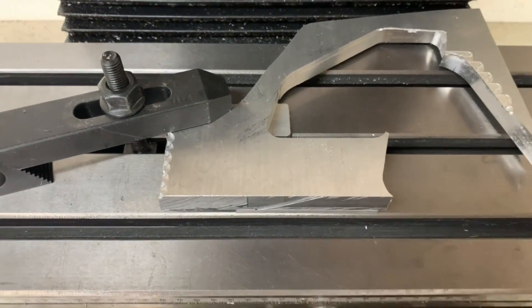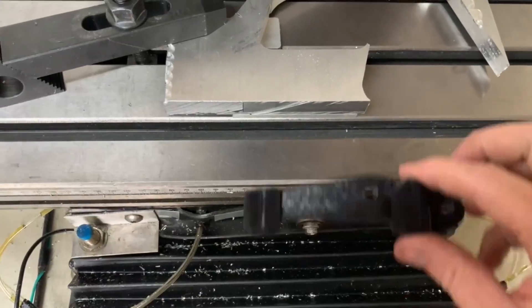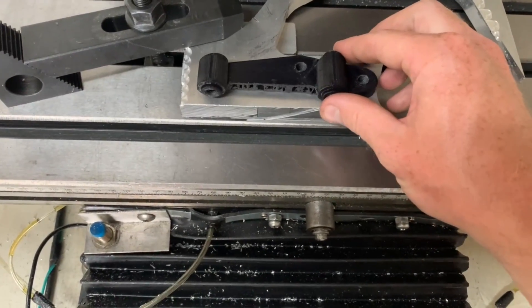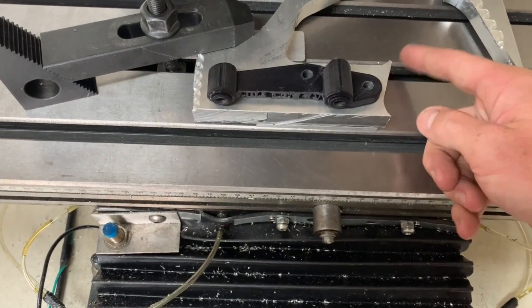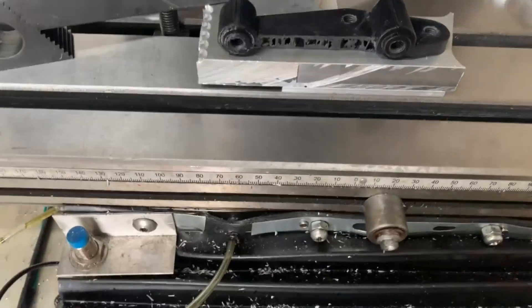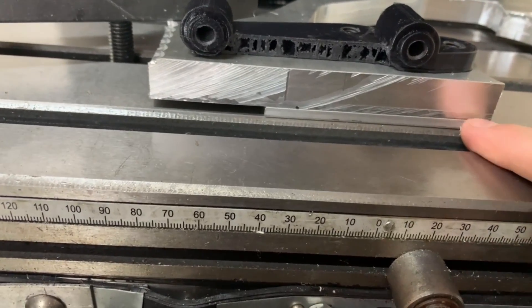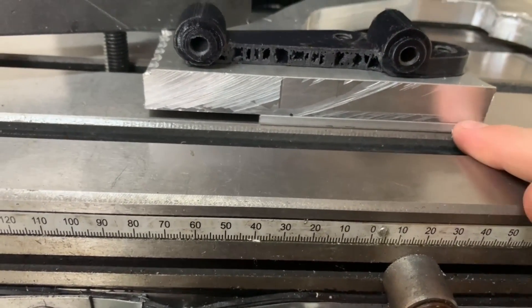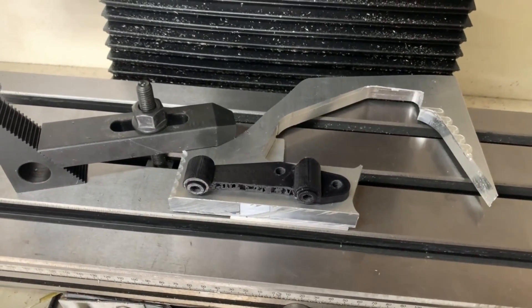So here's the setup — it looks real shoddy. We have one toe clamp because the piece of stock is obviously scrap and the part just fits on there. Because we have to contour the entire piece there's nowhere else to put a clamp, although it's sitting off the table on these three-and-a-half to four mil spacers — it's nice and tight under there. We'll see how we go.